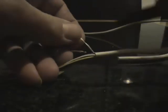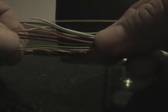And all I'm doing is just gently cutting around the edge, being careful to only cut the white sheath of the actual cable, just exposing the cores that we've got inside the cable there. Most typical alarm cables have standard colours. This 8-core cable has got white, yellow, blue, red, black, brown, green and orange. There's no specific colour codes that installers have to have, so the cores could quite literally be circuits or power or both.